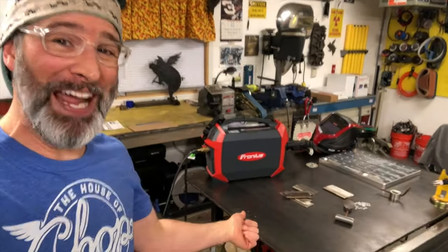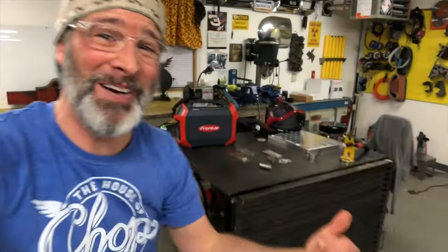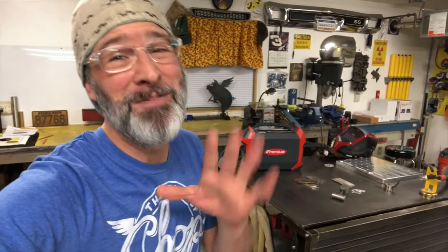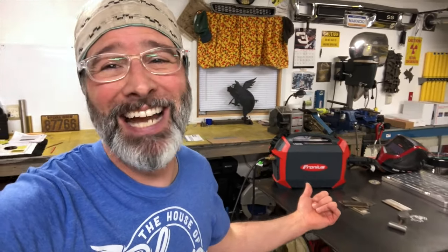I did 6 of those for a total of 12 of those really hot welds. The fan never kicked on once, ran totally silent, didn't hit the duty cycle, did not kick off a circuit breaker. Old TransTig over here is well up to the challenge. So with that said, I'm satisfied. I'd be very willing to end this video here and feel fully comfortable what the TransTig can and cannot do.